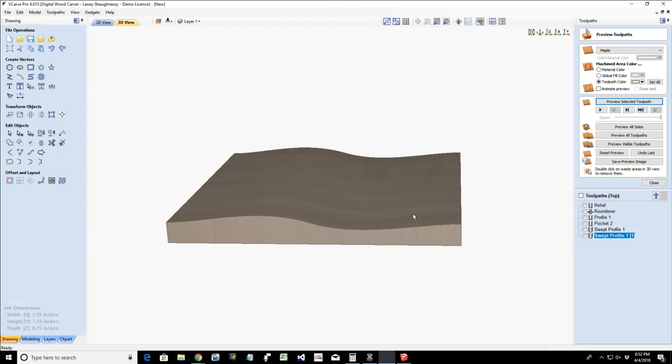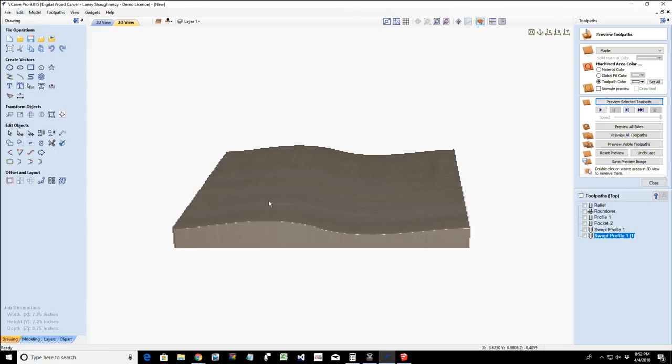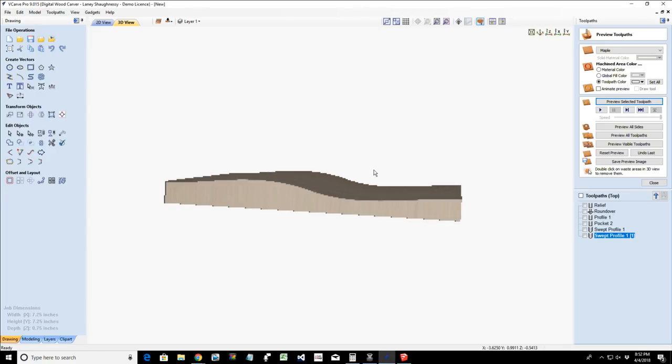And if you're ever doing bent lamination, this is the same process. Without having to have a spire, you can create your molds using a single line in the profile toolpath, the molding toolpath, should I say. But now I can put in some nice decorative thin strips, thin material. With my other solid piece that I cut out, that I mirrored and cut out, I can glue those together, clamp them and glue them together.